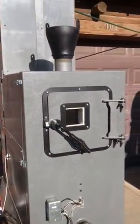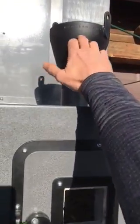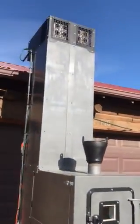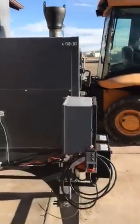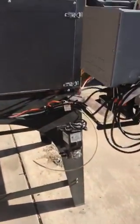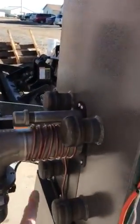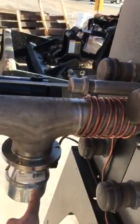This is the main unit here. The fuel comes in right here. There's your door. The heat exchanger is all the way at the very top. We have our quench pump down here below. That comes around, heats up, and turns into steam here and is injected into the biochar as it comes out of the auger.